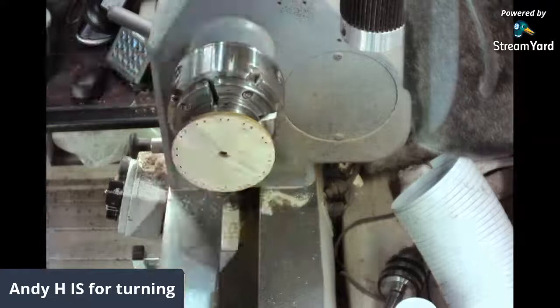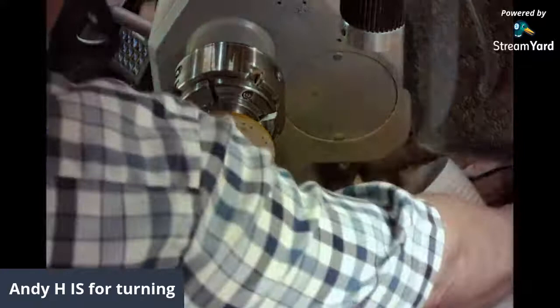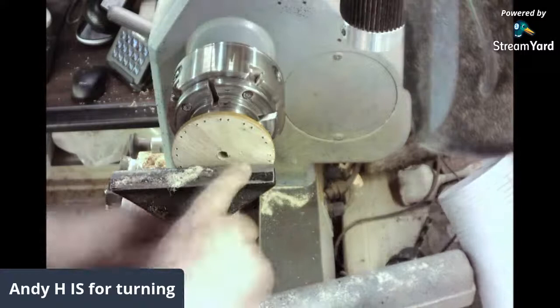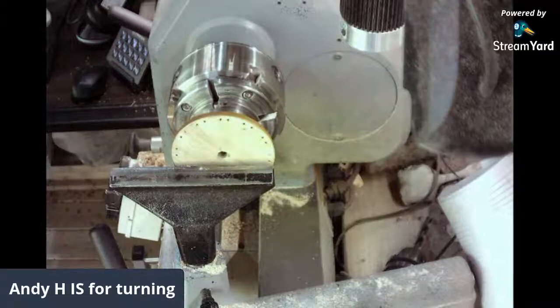And I've got a question from Gerard. I think it was me saying microfine instead of microcrystalline, which is what I meant to say. So you would use wax 22 over what you want to, and you can then put on a non-finger marking finish with the microcrystalline, not microfine Yorkshire grit. So hopefully that explains what I didn't explain very well just now.